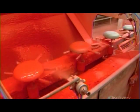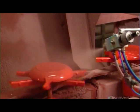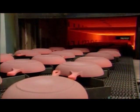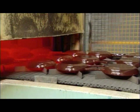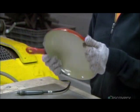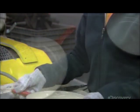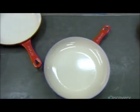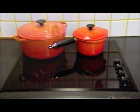The iron recipe contains a high level of the mineral silicate, which helps the enamel adhere well. Once again, the cookware goes through the dryer, then into the oven at 850 degrees Celsius for about 45 minutes to vitrify the enamel. Once the cookware cools, it undergoes a final visual inspection — the last of 30 quality control checks throughout the production process. Enameled cast iron cookware lasts generations because it doesn't warp over time and remains food safe for life.